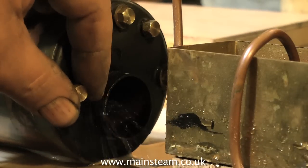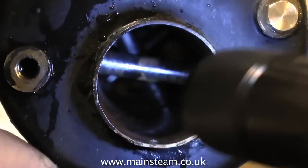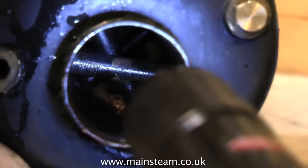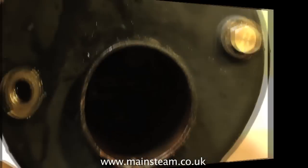What I usually do after a boiler test is give the boiler a quick visual inspection. Have a look down the centre flue — you'll need a torch for this — and make sure there are no bulges showing anywhere. This is quite an old boiler, but it passed the test with flying colours so it can be put into service.